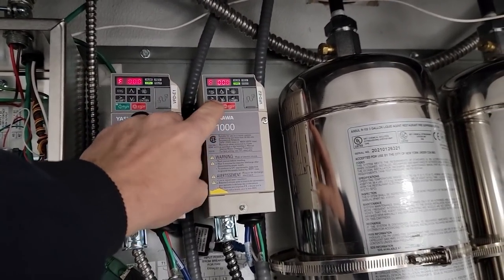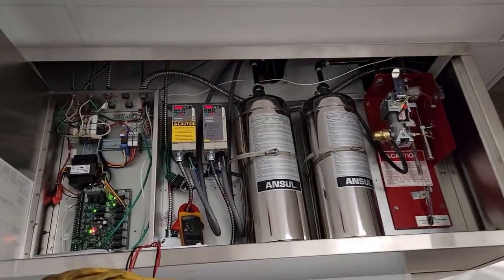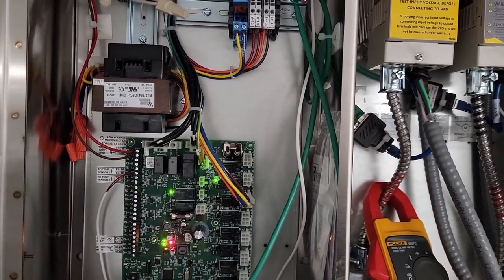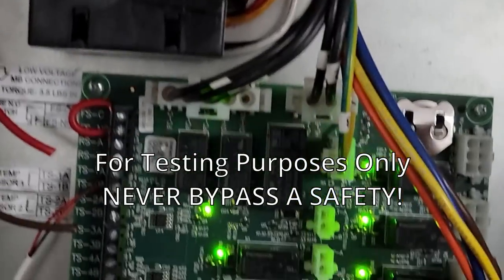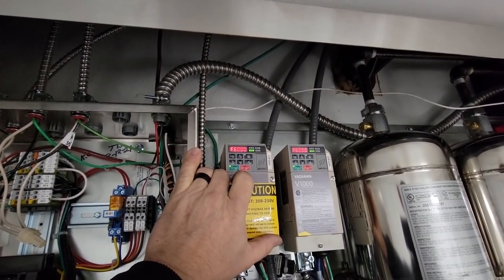Finally figured out what was going on — power's turned off because it said to leave it off. He's got this stuff all set up so we're supposed to start it up, and they've got all this other stuff disconnected, which really makes it difficult. We got rid of the fire alarm issue — it was a normally closed circuit and it opens when it does its thing, so we put a jumper in there because the fire people and the balancers still have to do their jobs.